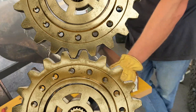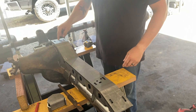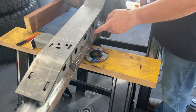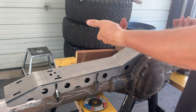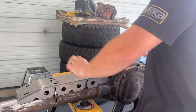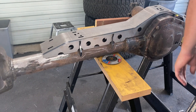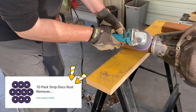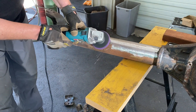Now we're switching gears to the plan for welding up the truss. I'll do full welds up here, tack these into place up here, flip it, weld the inside, put it back on. I've got everything marked. Now it's time to clean up the axle so we can weld on the truss. These purple pads are perfect — they cut right through that coating.